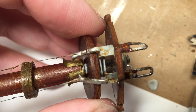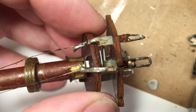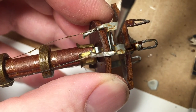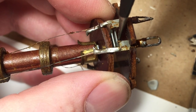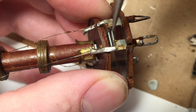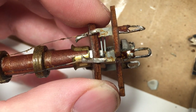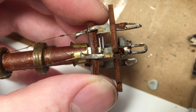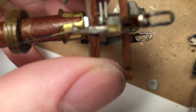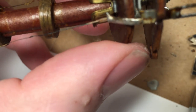Okay, now we're looking at the other side. You can see the two plates we need to trim off. For those who aren't clear — it took me a while to figure this out — these two plates are attached to these two pins. Prior to this, the silver mica material went in between them and acted as a capacitor. Now we're trimming those down so they don't short out. Another option might be to put some insulating material between them — I haven't heard of anyone doing that but it doesn't mean you couldn't.